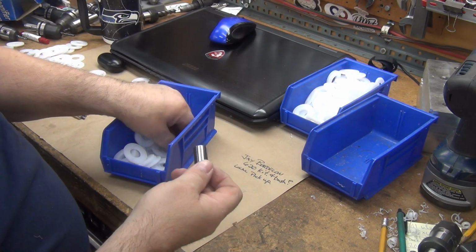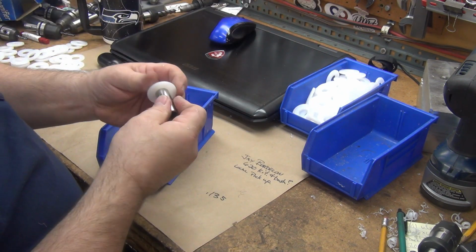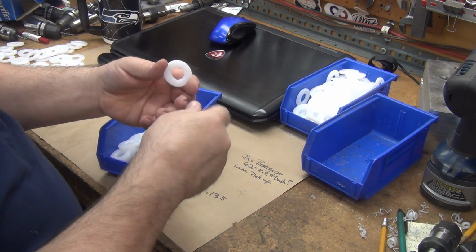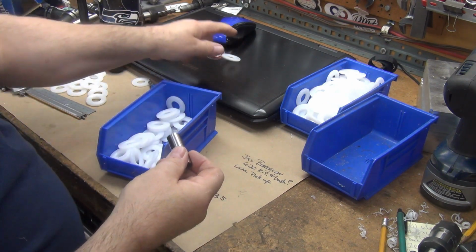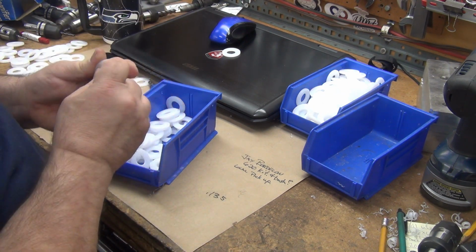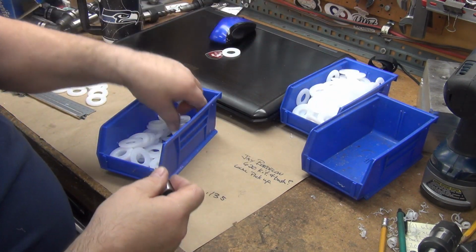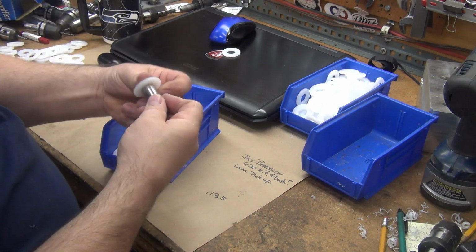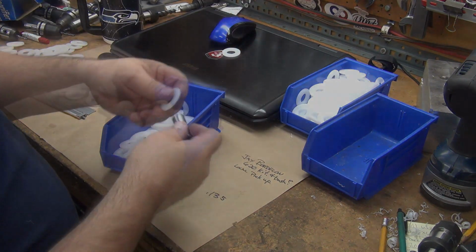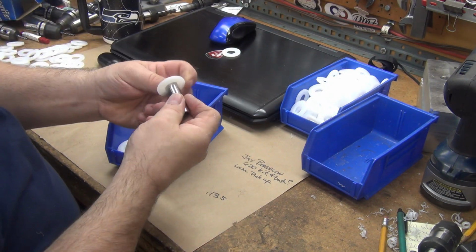So a bit tedious. If I do them again, I'd like to find a process that is a bit more predictable. I may set up tools differently on the lathe so that the ID is chipped or something. Do it so I can do it on the lathe and possibly even do one at a time, and then I don't have to deal with any flexing or anything like that. That would be fine, plus there'd be less issue with the chip buildup because it would fall off each time one was made. I'm real pleased with the wall finish with that cutter and the chamfer with that polished insert.